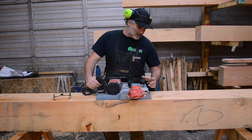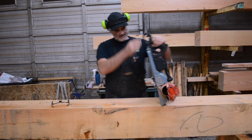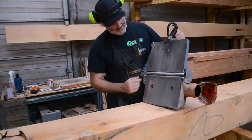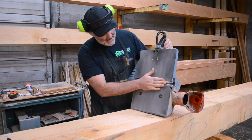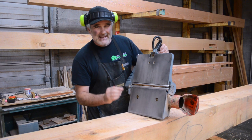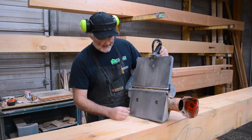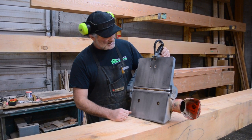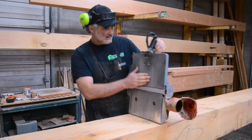When you're zeroing out your blades, basically meaning when you set your blades originally, the concept is to have your blade flush, or the same height or even plane as the back surface. I go just a hair more, and I mean just a hair more. That way I have a little more bite, and I like that, and it helps in the long run. We'll get more into that later, but I just wanted to make that an important aspect in setting the plane up.